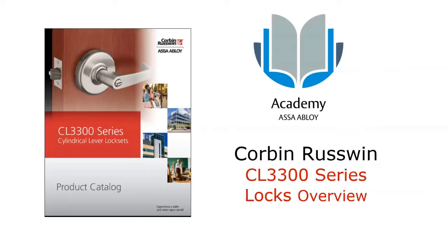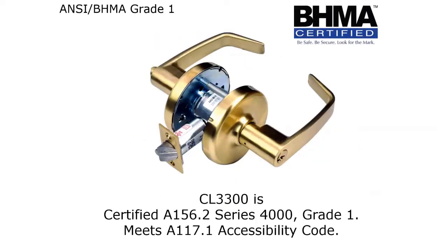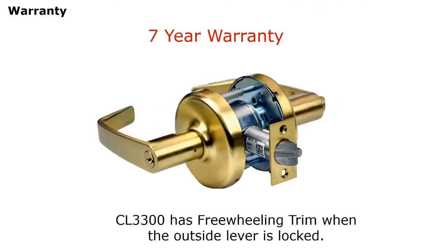Next, we're going to take a few minutes to talk about the CL3300 series once again. This is a lot different than the CL3100. As you can see, there are through-bolt holes, so this does require a modified 161 door prep. This is grade 1, and it does meet ADA requirements. This has a 7-year warranty, and once again, the trim on the outside is freewheeling when locked, which means it rotates without having any effect on the latch bolt.